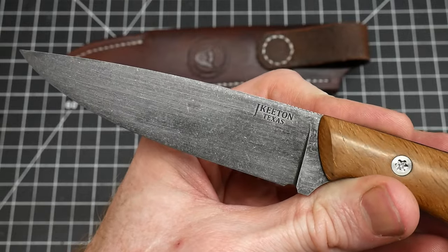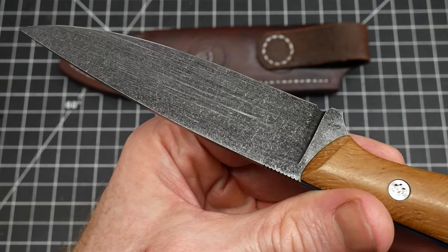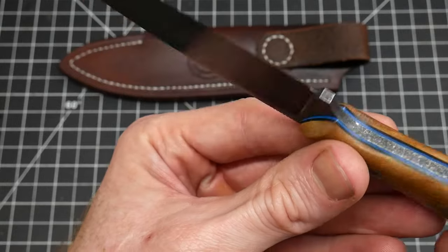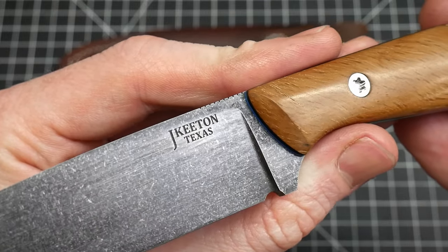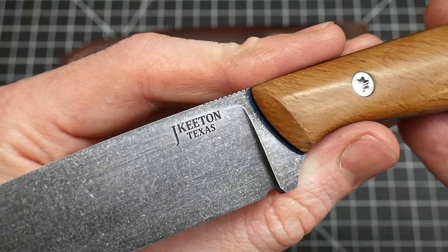The two things I can attribute this to are heat treating the knife in my forge instead of my PID controlled oven, and not working up the grit to at least 600 before etching. Both of these were done for speed and convenience, and are not what I'd consider best practices. That being said, I do think this forge heat treated 1084 blade will be a good performer for my friend. Obviously, if he ever has any issues with it, I'll just make him another one.